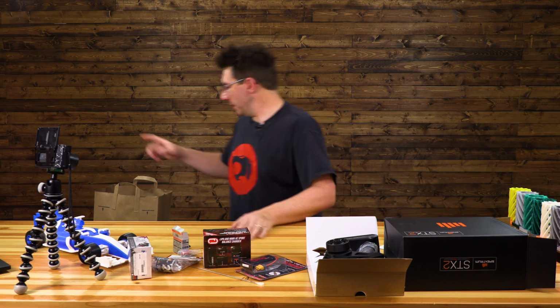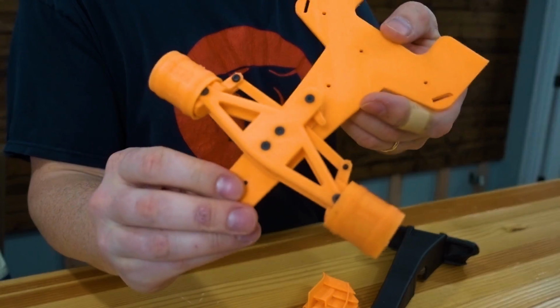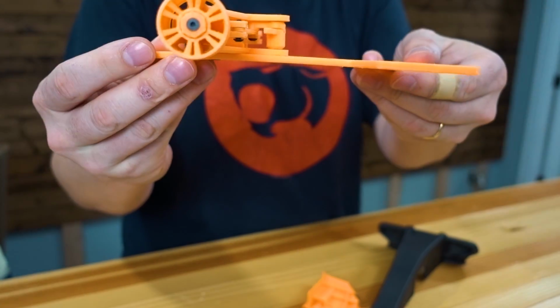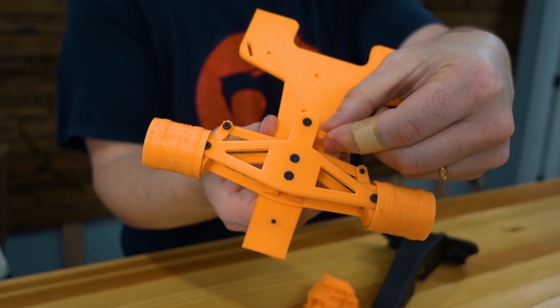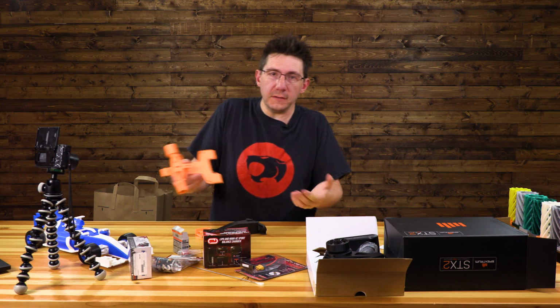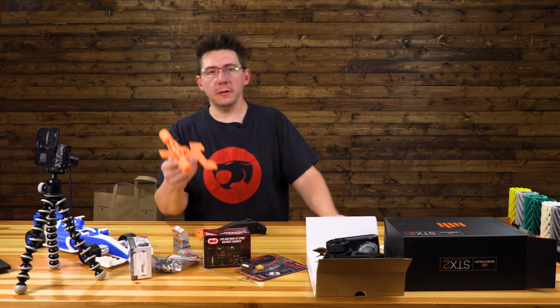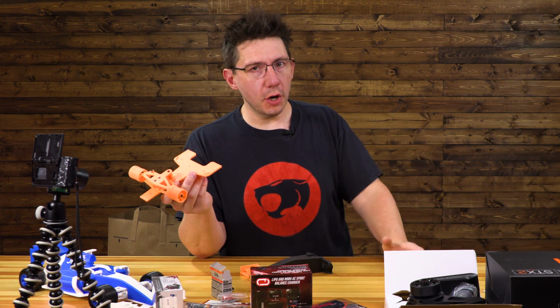Well, one of the things that I was worried about is this piece right here, kind of the forward piece. The Nylon G kind of bends a little bit this way, and if I try to turn the servo saver, it doesn't turn very much. Nylon itself is a bit of a flexible material. I mean, it's not rigid like PLA is rigid, and the glass fibers don't do anything to reinforce it, unlike the carbon fibers in the Nylon X. Here we go, see? I remembered all that.